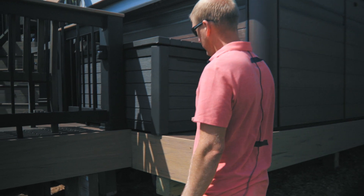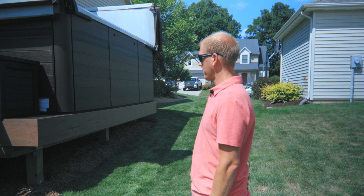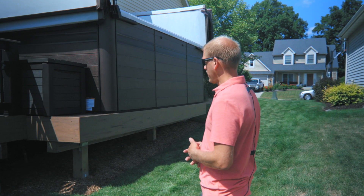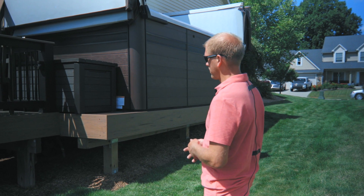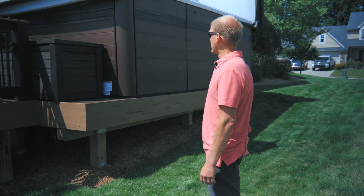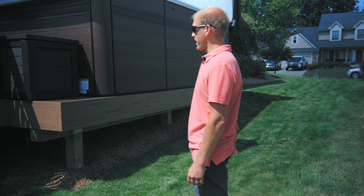I originally planned this deck and the existing deck to be the same height. The concrete is structurally fine with no cracks, but the entire deck sunk. I didn't have any kind of engineering done — no soil sample or anything. Maybe if you're going to put this much weight, have your soil checked. In my case it dropped about a half inch that I did not expect. Maybe next spring when the swim spa is empty, I'll jack it up and add some spacers to get it back to where I want it.